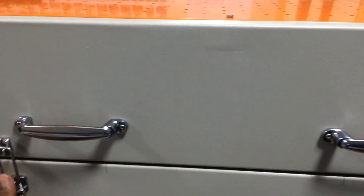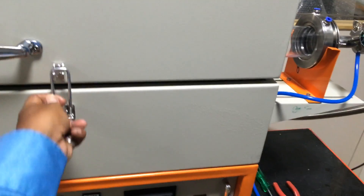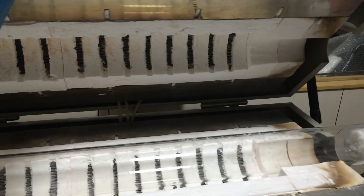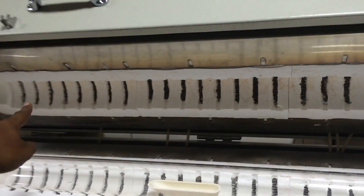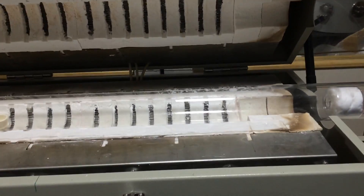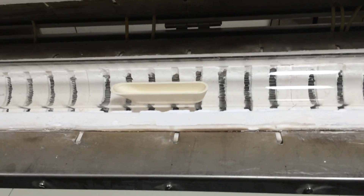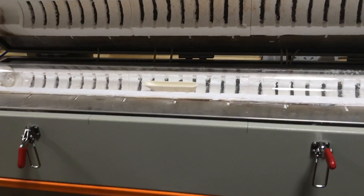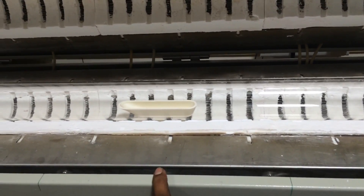You can see I am just opening the furnace. You can see there are three zones — zone one, zone two, and zone three. There is a quartz tube, and you can see there is an alumina boat in the middle. That is the exact middle of the hot zone, so in this middle hot zone you will get plus or minus 0.5 degree uniformity.